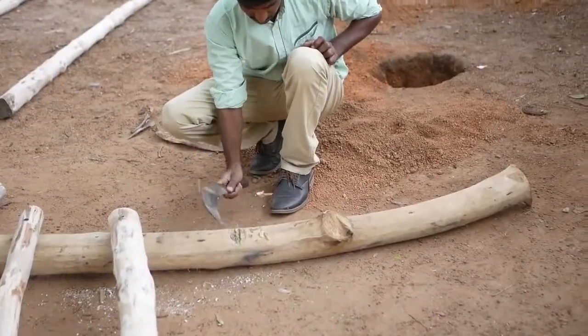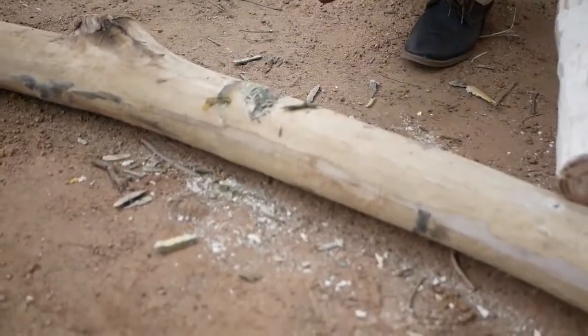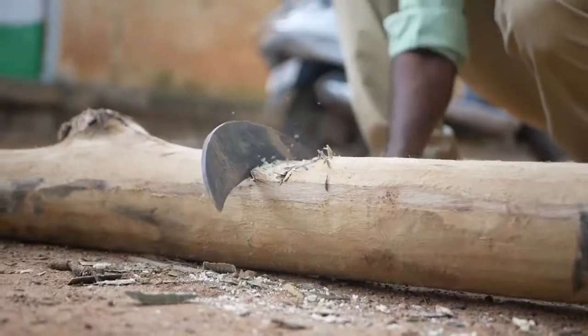If you use wood that's quite a bit larger, you might not actually be able to get the drill bit all the way through. I like to just take out some notches where you're going to be attaching the other piece — it makes a much stronger connection if you've cut little notches out of the wood itself, and then the next piece is going to be sitting inside there in a little cradle. Then you can bolt that through and it'll be really secure.